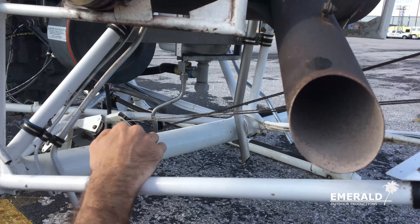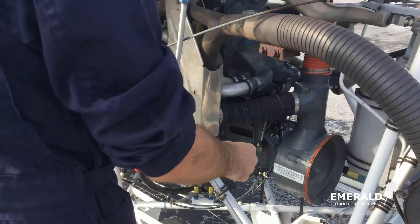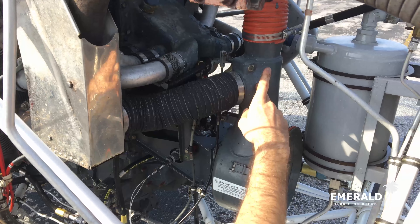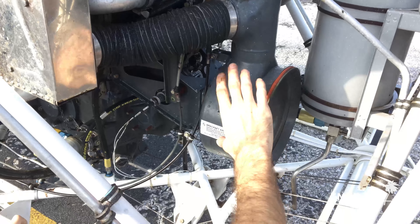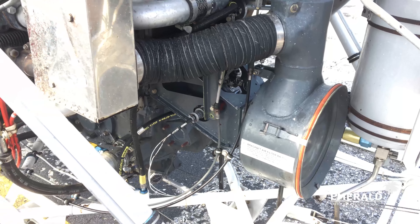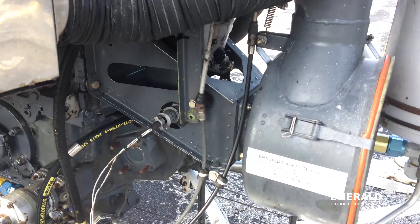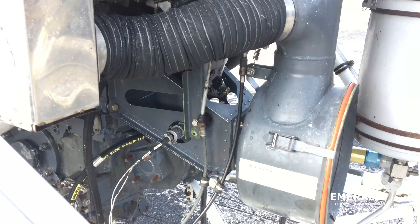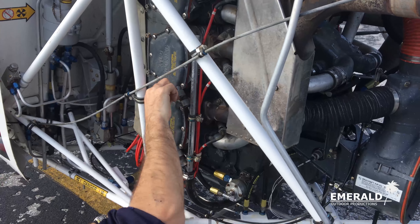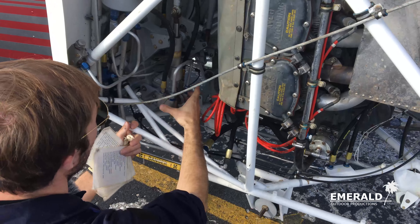To check the wire strands, you can take a piece of rag or cloth and run it down — whenever it hangs on those wires, you know there's a rubbing spot. I usually look down them and look for anything that sticks out. If a strand is broken it looks like a protruding wire; if it's just grease it'll look similar but won't be a strand. Check the rollers, continue down checking for any high-friction points — especially here where the wires can sit on a gap and vibrate.